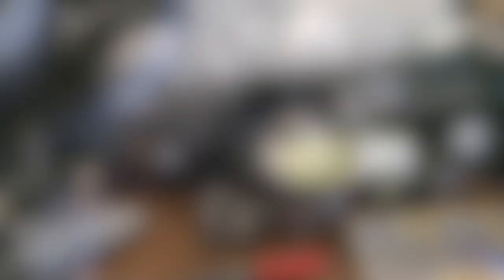The two chucks sit on chuck cradles I made from four-by-fours — I put them in the milling machine and turned the radius with a boring head. It makes taking chucks on and off the lathe much easier. You do not want to drop a chuck onto your ways, so if you don't have a fitted chuck caddy, at minimum put some plywood or boards across your bed any time you're changing a chuck — dropping something on your ways is a good way to wreck your day.